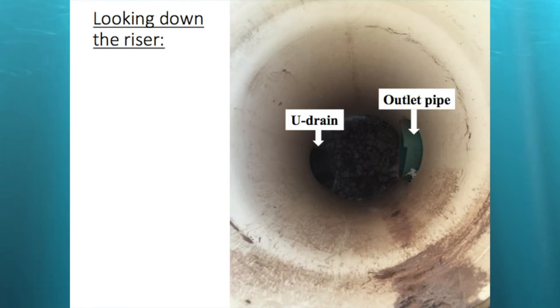Here's another version of this — at Perkiomen Township. We got a grant to install a rain garden there and used an under drain because it was in low-lying soils, pretty close to the groundwater table, with very clay, tight soils that didn't infiltrate well at all. There's the outlet pipe — it's about a foot higher than the under drain, so there's about 12 inches of internal water storage inside the planting soils, not on the surface.